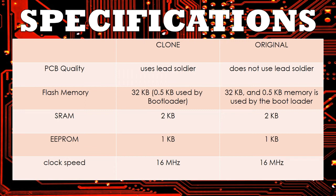By frequency we mean the frequency of the CPU clock. Say your Arduino Uno runs on 16 MHz, which is 16 million Hz. That means there are 16 million clock cycles per second. The CPU executes the bytecode of the program.